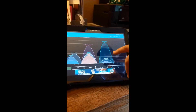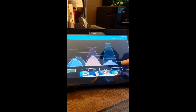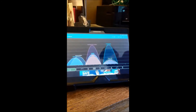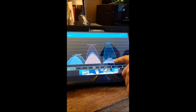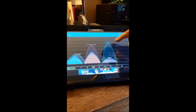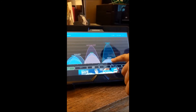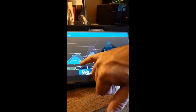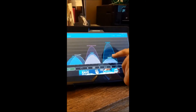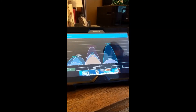During the installation, we analyzed the home and the surrounding areas to find out what types of Wi-Fi signals are being broadcast. Each one of these is a Wi-Fi signal from a home — you can see CenturyLink, even a thermostat broadcast, depending on what somebody may or may not have named it. Our goal is to put this Wi-Fi signal on the least-used channel and best location. In this case, there's not much going on on channel 11 — usually 11, 6, and 1. So we've added this signal to channel 11 so this house can get the best possible Wi-Fi signal.